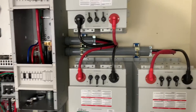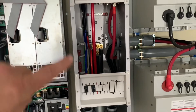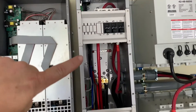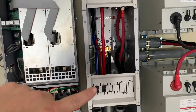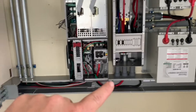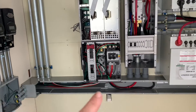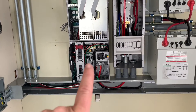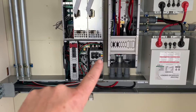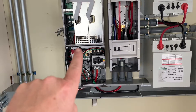The battery cables are all done. The solar — I had to take, like I was talking before, the solar feed is coming in from the pulldown switch. When I do a final video we'll go over all that. So the solar is coming in and I need to extend it. I put the main PV breakers in the FlexWare 1000, and then they'll come into the charge controllers, go out of the charge controllers, and terminate in the GSLC. The reason they're going to terminate there is we have the FlexNet that's going to do all the coulomb counting for charging the batteries and making sure it's going in.